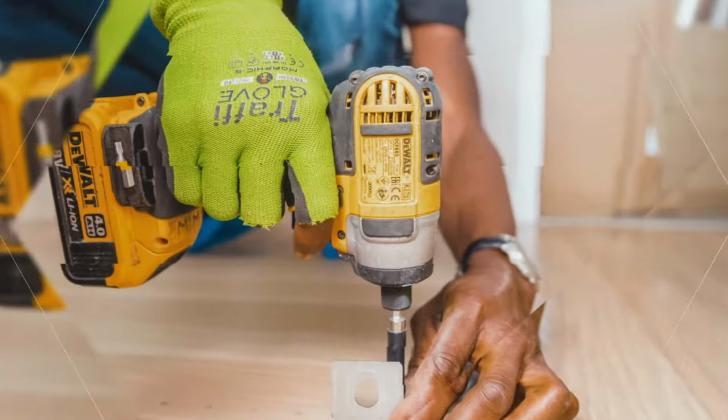Now these holes were drilled with the intention of using the drop-in anchors, the female version of a concrete anchor we just talked about, but the concrete slab bottomed out when we drilled it and we hit dirt. So we decided not to use the drop-in anchor because if we hit it with the setting tool, it would just fall through the slab out the underside. So after drilling another hole to test the area and finding that the concrete slab wasn't as deep as we anticipated because that hole bottomed out too and hit dirt, we abandoned one drop-in anchor in a hole for fear of it dropping through the other side and decided to shift placement, drill new holes, and use the male concrete anchors instead.